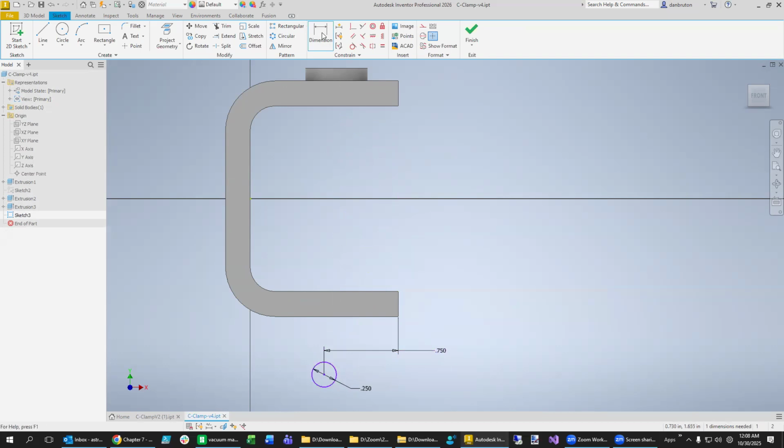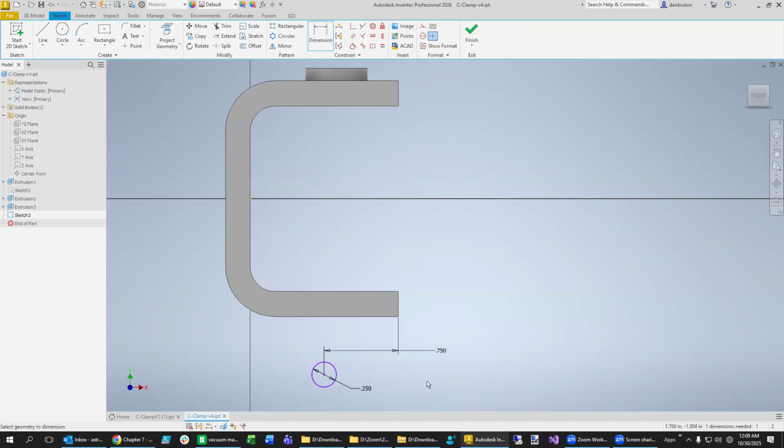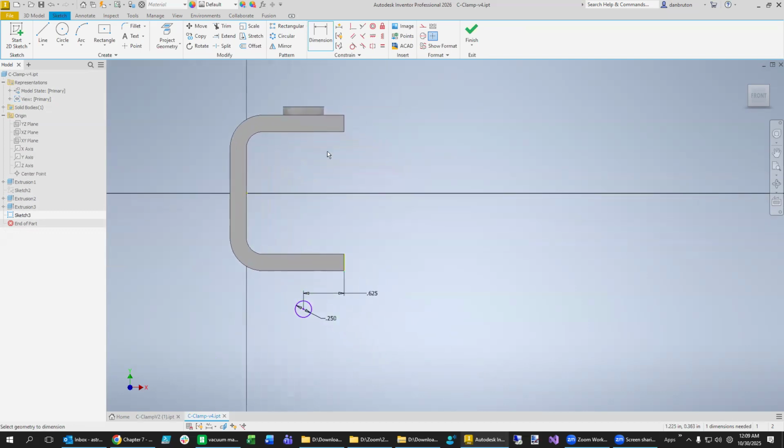It may not be that way. So we're going to go up here and measure here to there. Oh, we see that it's 0.625 there instead. Probably because of the way that we did that. So maybe not have it right there. Let's make that distance be 0.625. So you do have some design freedom. This is kind of an unscripted lab. You can decide some design changes on the fly, as long as you get the main ideas going here. Oh yeah, this one's 0.75. We said that one was a half, but I think it was because of the way that we centered it up on that platform that became somewhat different.